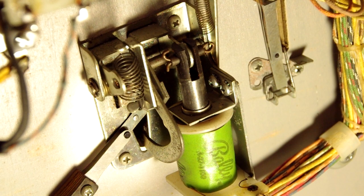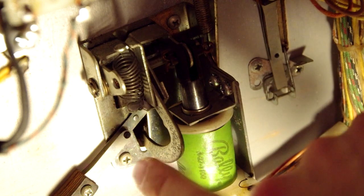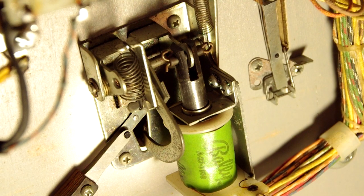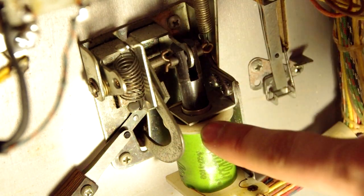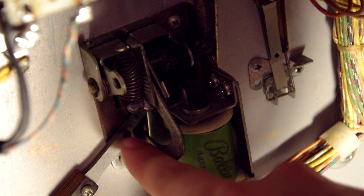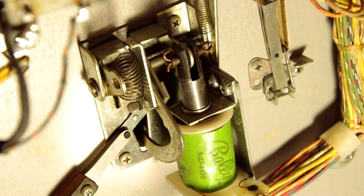This is the mechanism for the kick-out hole, and it's both complex and simple at the same time. It's simple in that all it's doing is moving a lever which forces the ball out of the kick-out hole. The reason why it's complex is because the lever system itself is kind of complex — there are two different springs and it's also adjustable so you can change where the ball goes once it's kicked out. This switch here is what actually tells the machine that there's a ball in the hole, which energizes the kick-out hole relay. That starts the sequence that adds the points and at the end causes the solenoid to fire and kick the ball out.